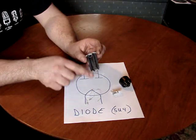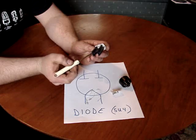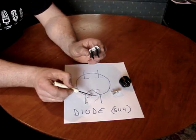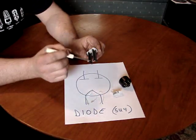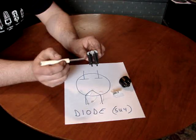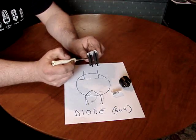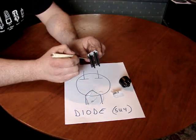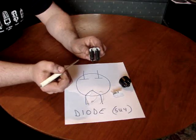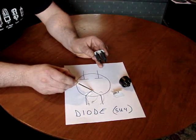So you basically have this thin wire run up through this plate and back down and out the bottom of this hole in the plate. It doesn't touch the plate. There's airspace all the way around. Now when you energize the tube, this wire will get hot and glow, and once the tube starts conducting, current will flow from the cathode to the plate, and only one way, because it can't flow from the plate back to the cathode because the plate itself isn't hot, it's only heated indirectly from the heat of the filament. There's no coating on the inside of this. This is just metal, so there's nothing that will release the electrons backwards. Therefore they only conduct in one direction. Hence it's a diode. It only allows electricity to pass in one direction, from the filament or cathode to the plates.